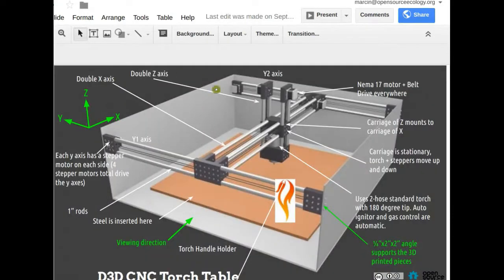This approach is much more accessible — similar to building a 3D printer. The Prusa i3 has about 100,000 sold, and many more self-built, so many people can work with this kind of system. The one detail: a very large machine like the one-inch rod version at four meters long is too heavy — the rods sag — so we used three-quarter-inch pipe with a 1.05 outer diameter instead.